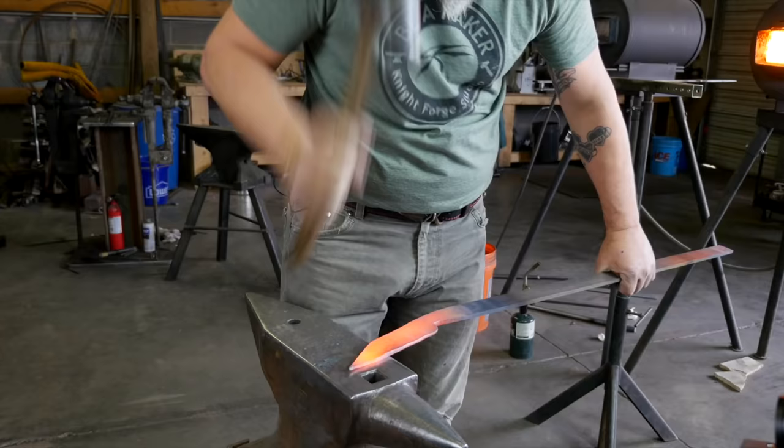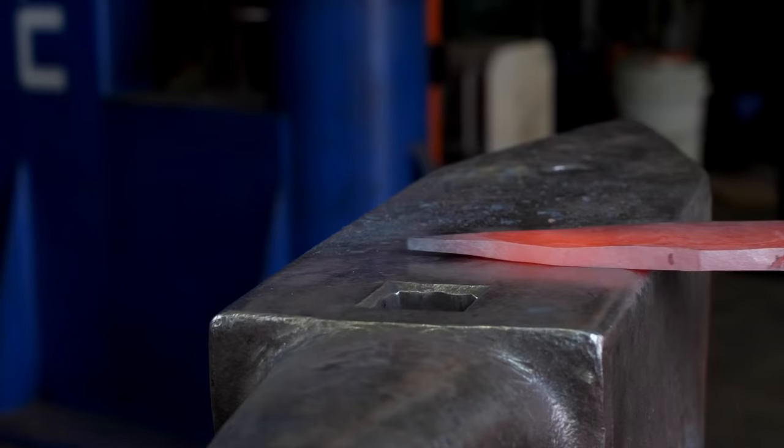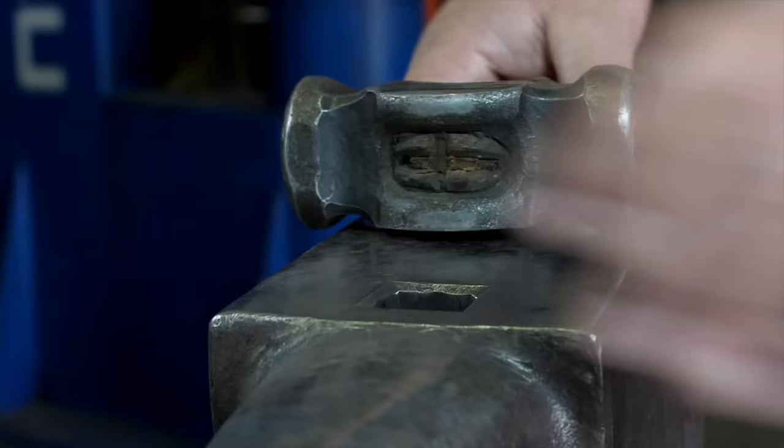I'm moving it back and forth a little bit because I'm getting out here where the tip is. Probably the most important thing here is how your anvil is mounted. If you notice, I have a steel three-legged stand — these legs are on about 23 degrees. No matter what surface I set this on, it's going to be even. I don't care about level, but it won't rock and bounce around. Second thing: 100% pure silicone — silicone the anvil to the stand.